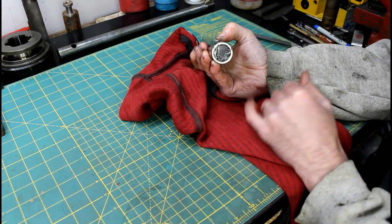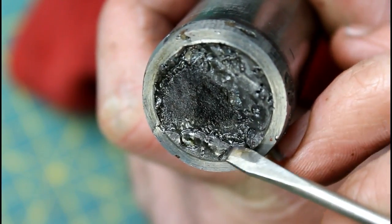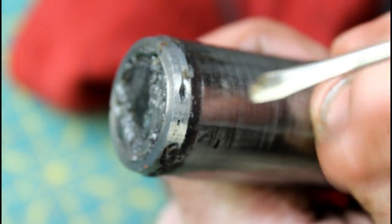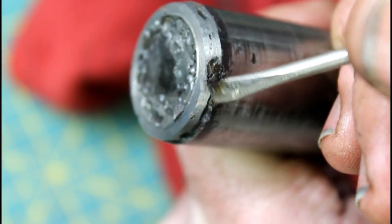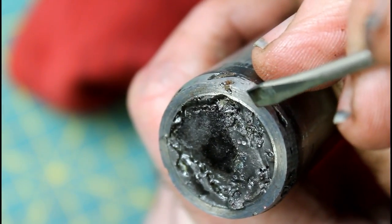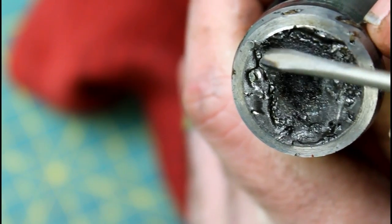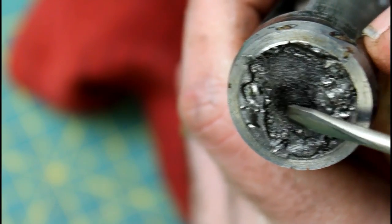Let me get you a little closer shot at this thing. Let's see, that looks like a liquid almost. Looks like JB Weld to be honest, but it's not. And then I'm seeing, you know, these here. That's somebody's tried to weld this and it's been ground on. And looks like when they recut this or machined it, they had a sharp shoulder there where it separated. Just a poor repair is what it looks like to me. This is where they had no bonding at all with their weld penetration. This is just my opinion. It looks like it got into here, almost nothing here.